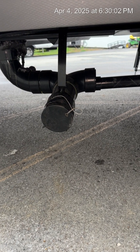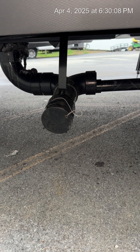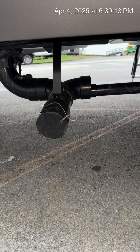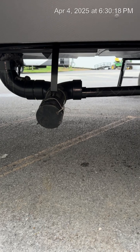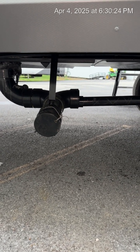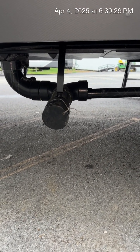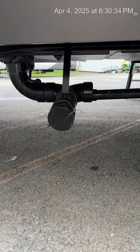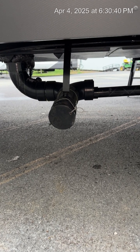The issue with that is that only liquid is going through the sewer hose. Everything solid is staying behind and drying to the bottom of the tank. You don't have to be those people that don't use your bathroom, the toilet in particular, like it's intended. As long as you use RV toilet paper and your toilet treatment, use it like you would at home. Just remember, if you leave the valves open and it's connected to sewer, only liquid's going through the hose. Everything else is staying behind and drying to the bottom of your tank, making that little pyramid in there everybody talks about.